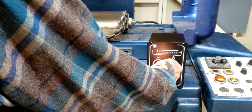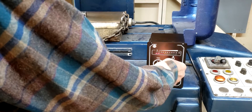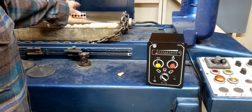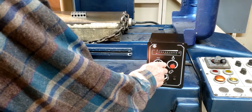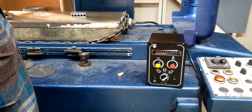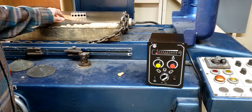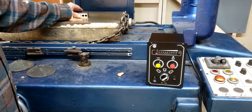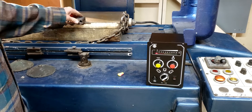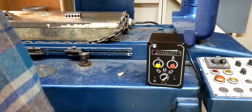Let's try it again. I'll go back here, go up - I don't want to go past 80. It sucked on real good. We go down to zero. I can still move it but it's stuck on there pretty good. Then we go over to release, let it go through its cycle - the more timer you have the more it goes through the cycle. Now we're done, it just lifts off. So you don't have to worry about dragging your freshly ground part across the magnet and scratching up the other side. Nice feature.